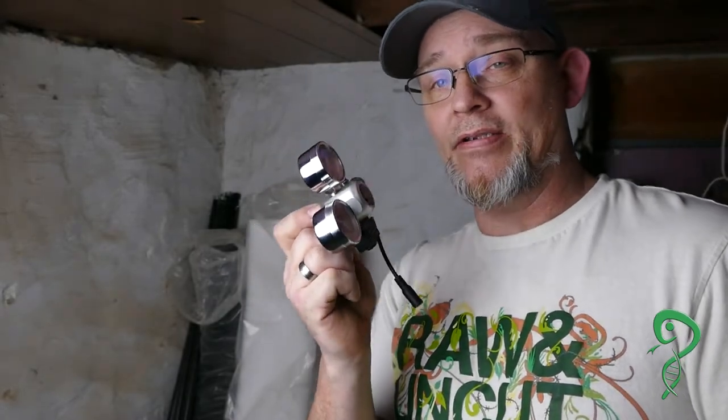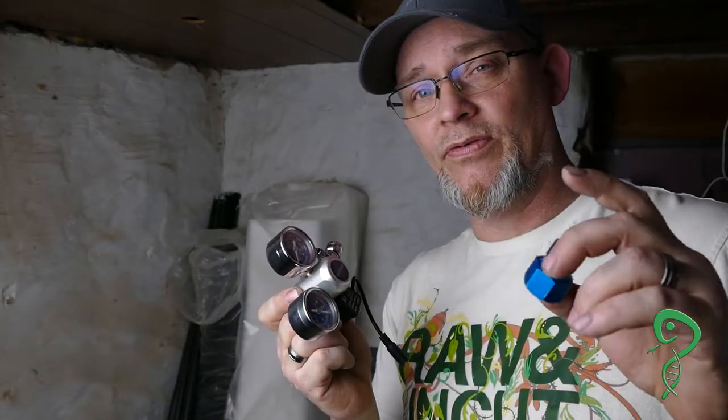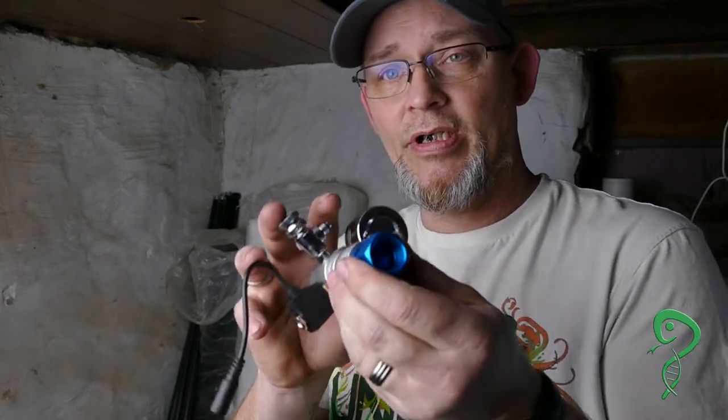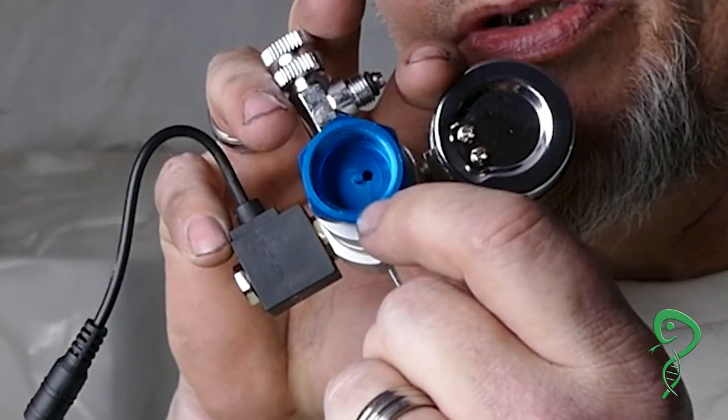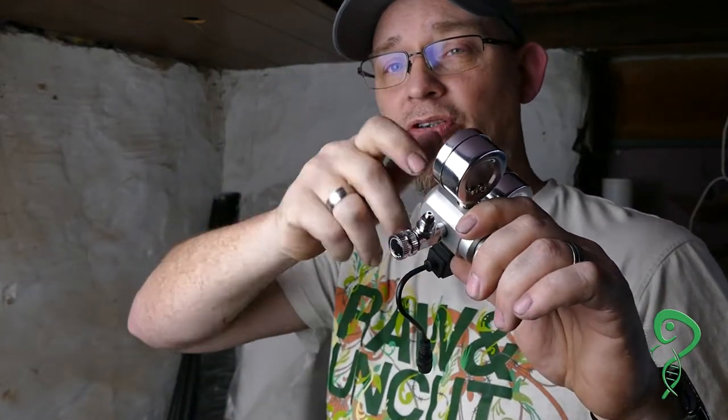Most importantly, this regulator will not fit on the top of that CO2 canister right away — you need an adapter. All the links for all this stuff will be down in the description. This adapter will screw onto the backside of this fairly easily. You don't want to get it just hand tight; you want it actually tighter because it's going to be under CO2 pressure. There's a little nipple on the inside that pushes into the canister to release the CO2. You've got to make sure this is completely off, which doesn't take much to screw all the way down because this is the on/off. More advanced versions have a dial on the front you can turn on and off, but I didn't want to spend that amount.